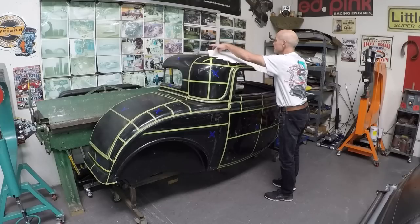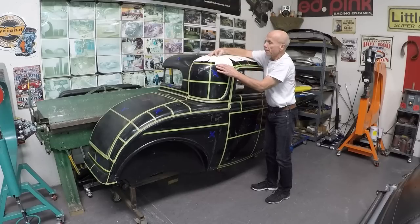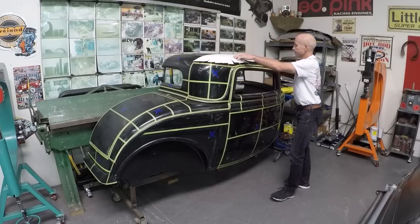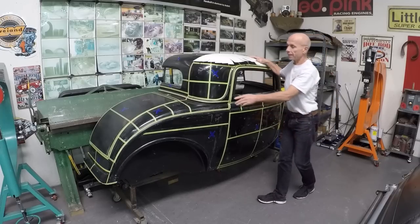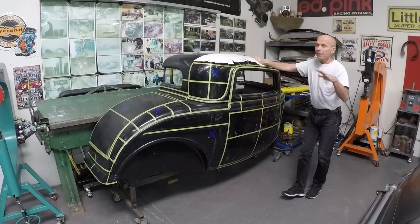For the roof panel, I cut in with scissors until the bubbles disappear — that tells me how far in I need to shrink it, but I need to be consistent all over. When I shrink with the deep shrinker and if I can't reach far enough with the five-and-a-half-inch depth, I can roll it up a little more to help me get the right shape. From this paper I can add for the flange whatever I need to add. Remember: always do the paper layout — you save so much time and it makes it so much easier when you make the panels.